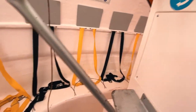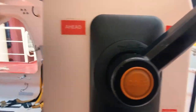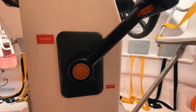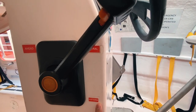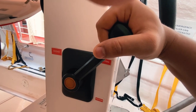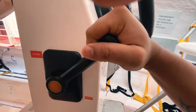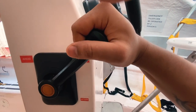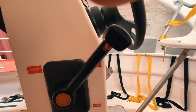To move ahead and astern, the system design is here. You can see there are markings for the ahead and astern directions. To move ahead, we pull the handle and move it to the ahead direction. To bring it back to astern, we press it back, then return it to neutral.